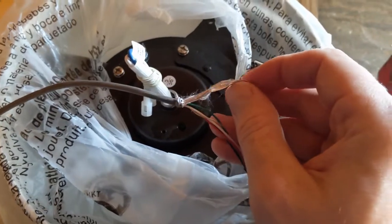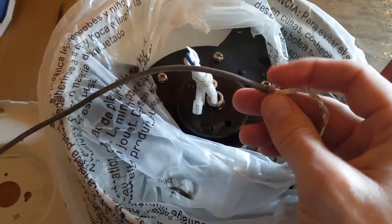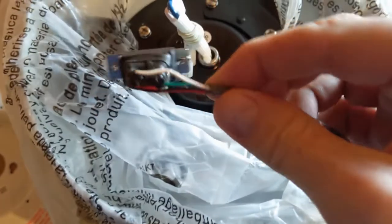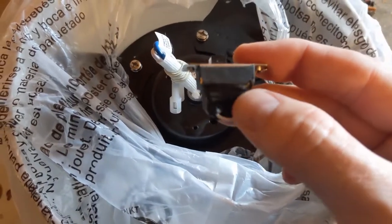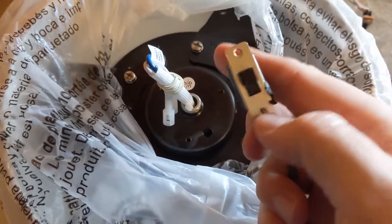The other reason is that it meets the requirements for constant current - the fan should be doing under two amps at most, and that's under stall speed, meaning zero speed max. So this is right here for signals; it's rated high enough for constant current but it's going to produce heat. This is the one I actually finished right here - I have it wrapped up with splicing tape on top of the heat shrink so everything's isolated from each other. I even added a ground to the switch itself.